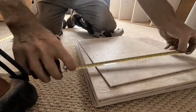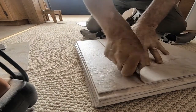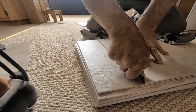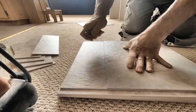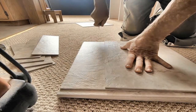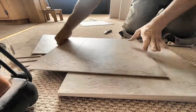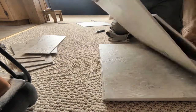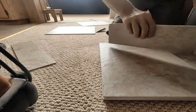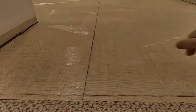While we wait for the glue to dry we can remain productive by pre-cutting some of our tile. I use a sharp utility knife to score a line in the wear layer of the tile and break it along that line. For the first one I used a tape measure and framing square. For the rest I used the first piece as a template and a guide. As you take tiles off the stack you'll have less range of motion for the break — you can grab a handful to take care of that.